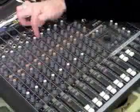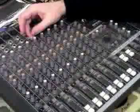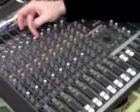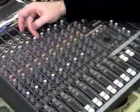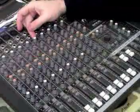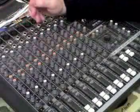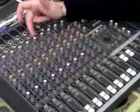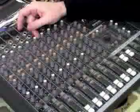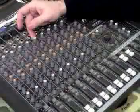Now this desk has a very handy yellow LED just next to the gain control that gives you a very quick and dirty guide to whether you're about right or not with the gain. So on this particular desk, if you make your noise into the sound source, into the device, so like you shout in the microphone or sing at your normal volume, should I say, and adjust the gain control on this desk until that yellow light just flickers on and off now and again when the channel peaks. If it's a constant yellow, the gain's too high and you're going to get that clipping and overload on the channel. If the light isn't lighting at all, your level is too low and you're not getting the maximum benefit out of the mic and the gain control.